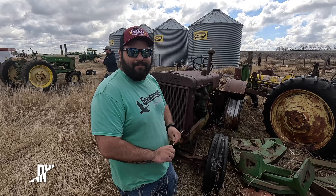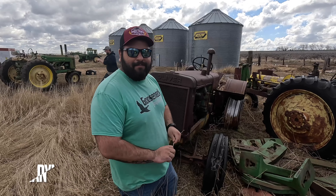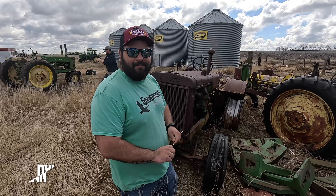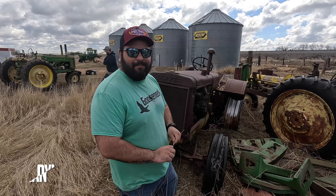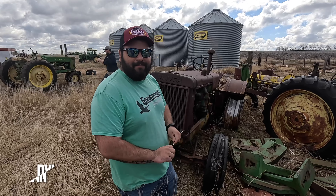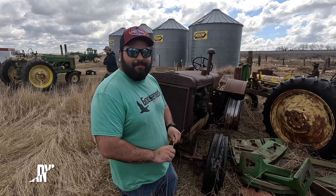These kits originally would have come with a 3160 Cat, so this has been repowered. It's a remanufactured engine with all brand-new oil in it. We know nothing about this engine - it could be fresh, we'll find out when we get it running. The local truck shop is trying to source me a new diaphragm lift pump. I was turning it over with the starter and there's no suction on the suction line with that diaphragm pump.